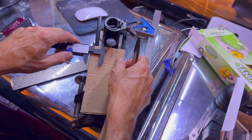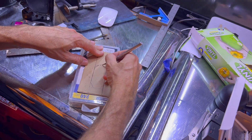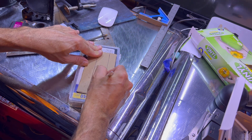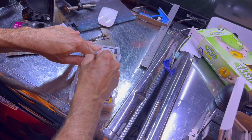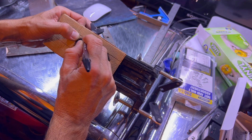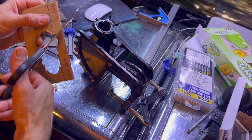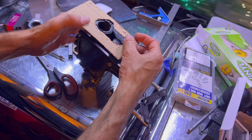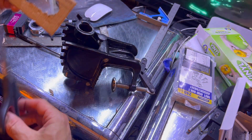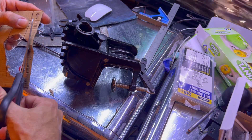At this point I'll show you how I made the steering assembly. The original 65 kilogram servo at 7.4 volts that I used to control my small 1800 watt trolling motor worked beautifully for years, but when I upgraded the motor to the new 3200 watt one it wasn't able to keep up. Under full acceleration the 3200 watt motor would overpower the old 65 kilogram servo. So I decided to use the largest servo I could find for this new 5 horsepower 3200 watt motor.